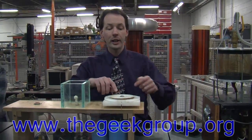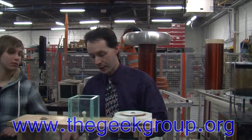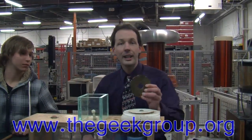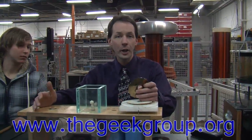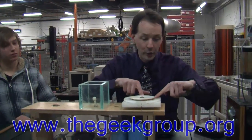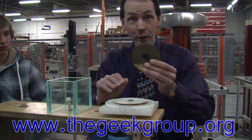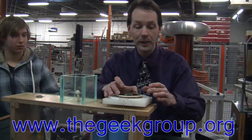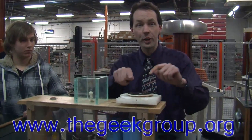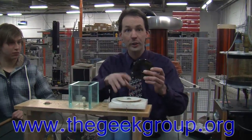That creates an electromagnetic field that comes out, and if you put a disk of aluminum — which is not magnetic, you'll notice these don't stick together at all — any time you have a conductor with electricity flowing through it, it creates a magnetic field. So this conductor with electricity going through it creates a magnetic field, and when you put this, which conducts electricity very well but isn't magnetic on its own, in that field, this magnetic field from here induces a charge in here. So there's actually electricity flowing through this — it uses inductive coupling.